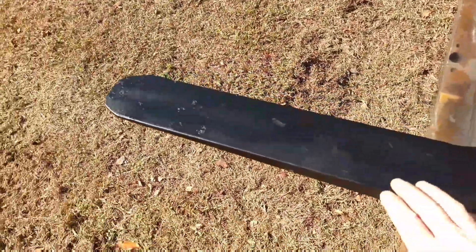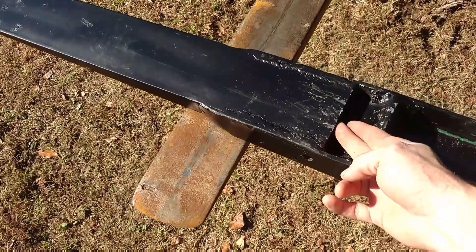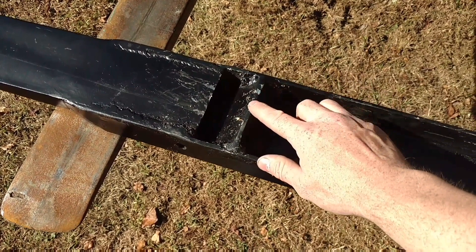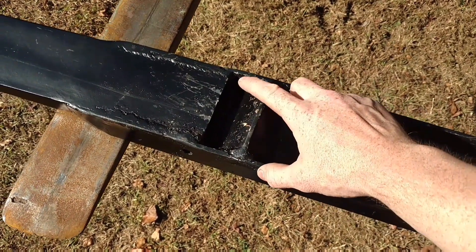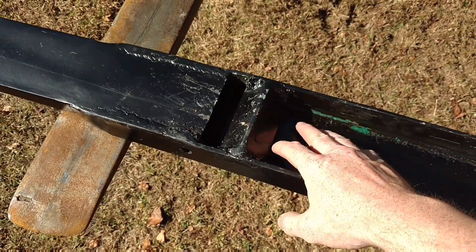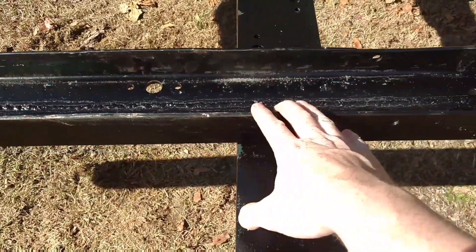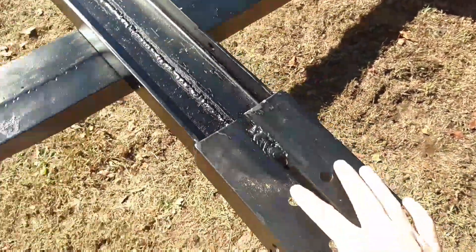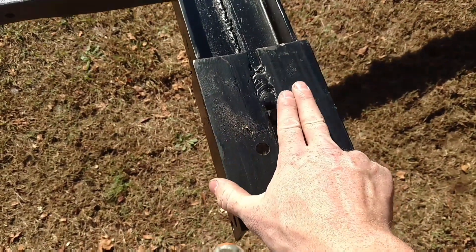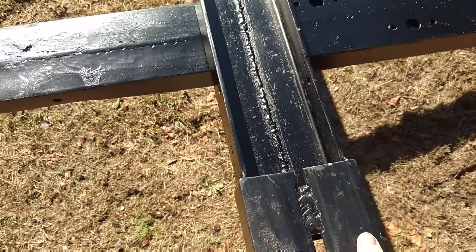This is upside down now — these are the original short forks we didn't have much use for. He cut them down and welded them onto those pieces of angle, put a small piece of angle iron in there to help bridge and support the two pieces, and this open channel is where the fork sits in. On the backside he has two more pieces flipped the other way, with a piece welded across to help support the fork.